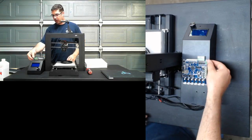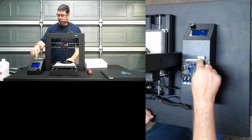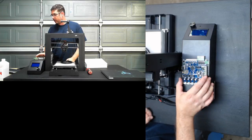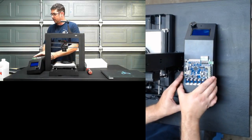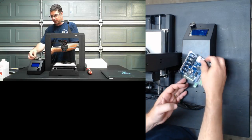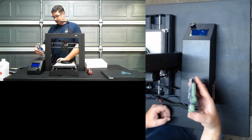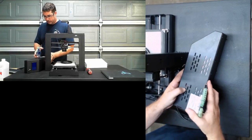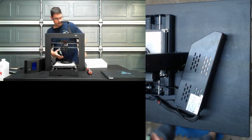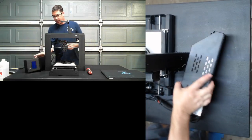So short answer, without some minor modifications to the board, which could possibly change the orientation and make these vertical entry for the MOSFETs, it will not fit inside the box. It's too much of a close call. Any way you slice it, because it's pretty much a square box and a square board, there's too much here, it's too tight. I guess we could also look at it vertically, and no difference. It's pretty much square. So that option's out.